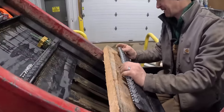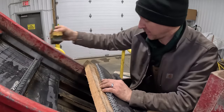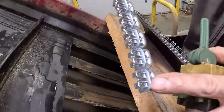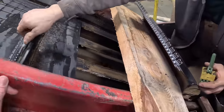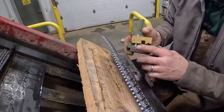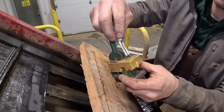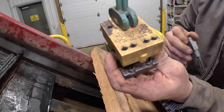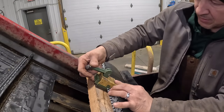I'm going to say this video is going to help me out in the future. The alligator lacing has these little staples pre-started in them, and those staples are going to go through the belt and out these holes, then bend over. To accomplish that you need the special tool — this piece here is what pushes down on the staples, it's got little grooves in it. We'll start from the middle and work our way out.